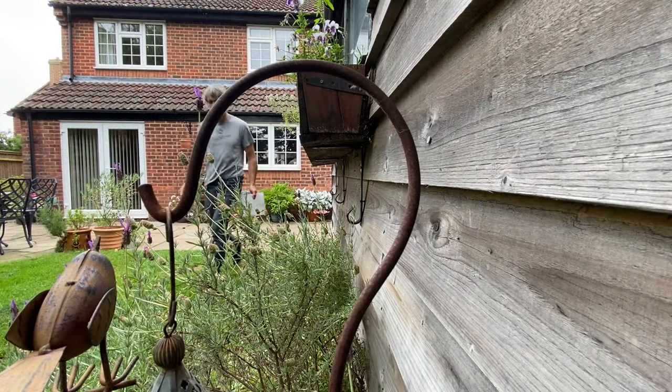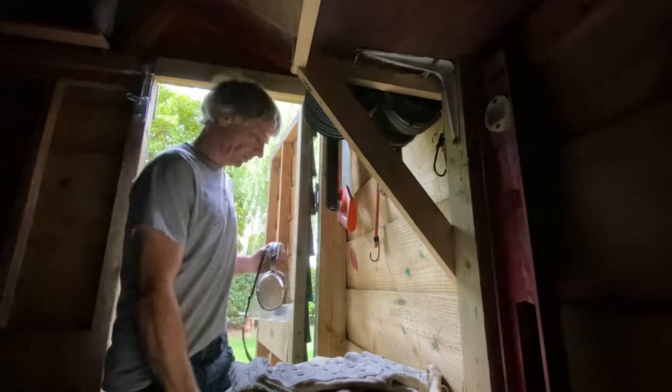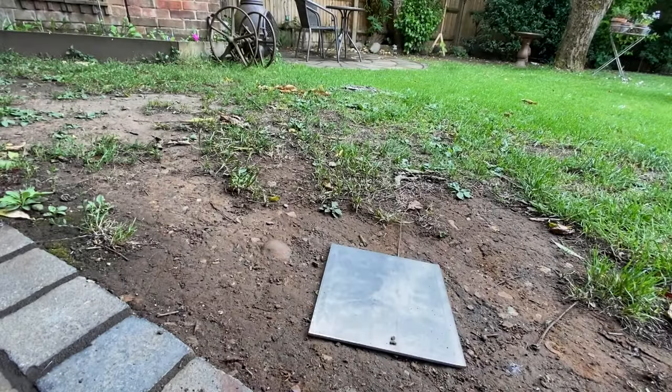With everything marked out, I go out to my shed to use my angle grinder. This is a good way of cutting stainless sheet. If you use the 1mm thick disc wheels, it cuts like butter.